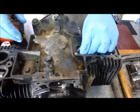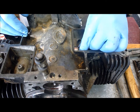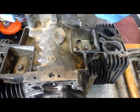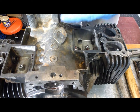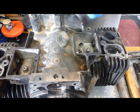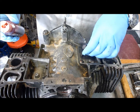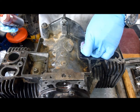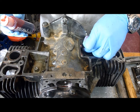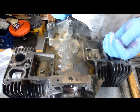One important note: I use the identifiers left and right to identify sides. Don't short yourself on assembly lube — that's my philosophy, because you don't want any wear to occur at startup when you first start this engine. The nice thing about assembly lube is it's nice and thick and sticky. So now we have the lifters installed.